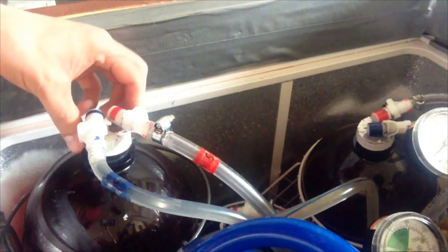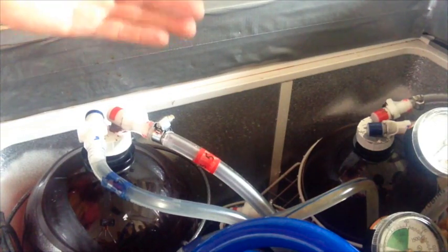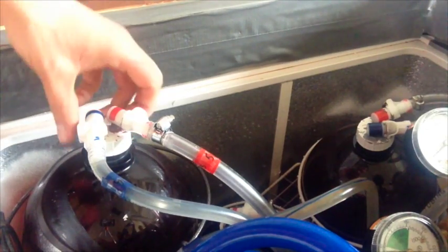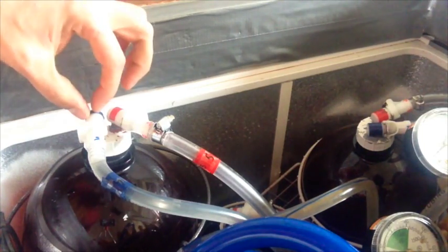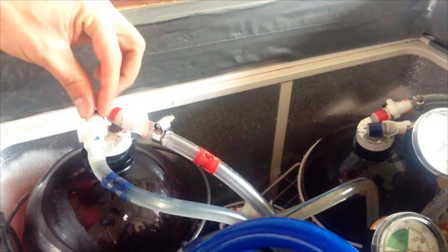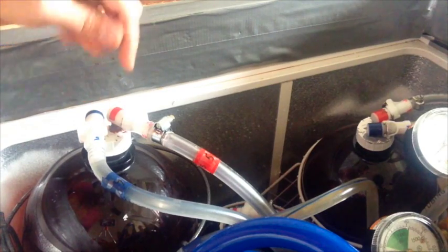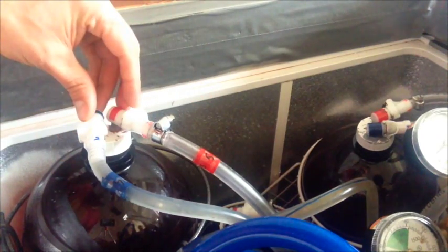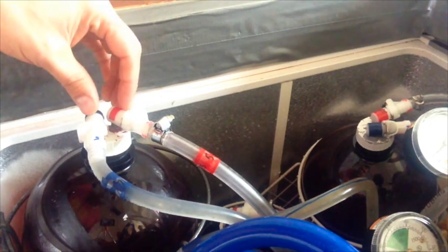This is the white cap you'll find on the BG Sturman website. My parts list is on YouTube, so you don't really have to listen to me too much on that, other than just to see how it's done. You take the cap, you drill two holes in it, and then you put these pieces — these valved quick connects, the male ones — on top of the cap, and then you glue them, because it's basically like a straw fitting in there. It holds pressure very nicely. Go with these connects — I haven't found anything better, and I think these are fantastic.